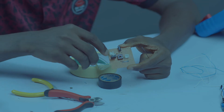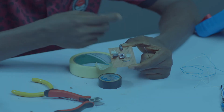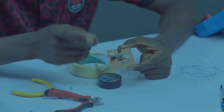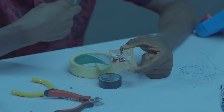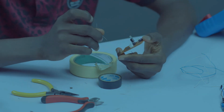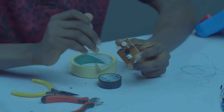The first pin is coming from 12 volts to the first leg of the 7805, which is the 12 volts input. The pin inward is the negative pin going to the middle of the 7805. The last pin will be the voltage regulating pin, which is 5 volts. So it will be regulating whatever this 7805 is taking in, then giving out our desired 5 volts. Isn't that beautiful? Okay, let's move on. So our pin 1 will connect to the middle of our 7805. So let's proceed on the routing.